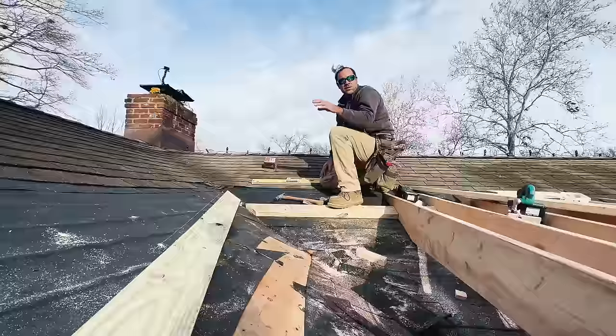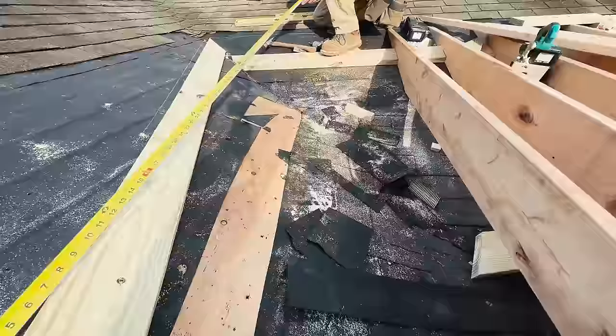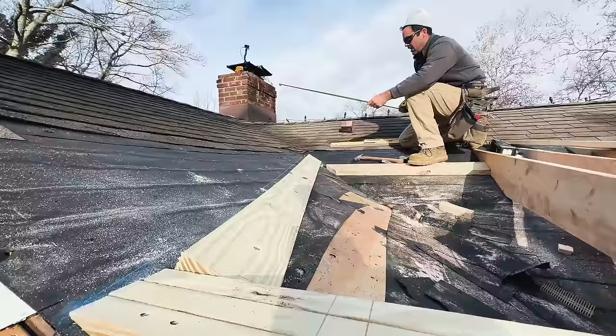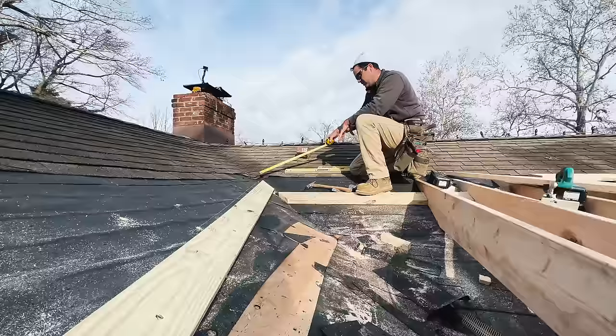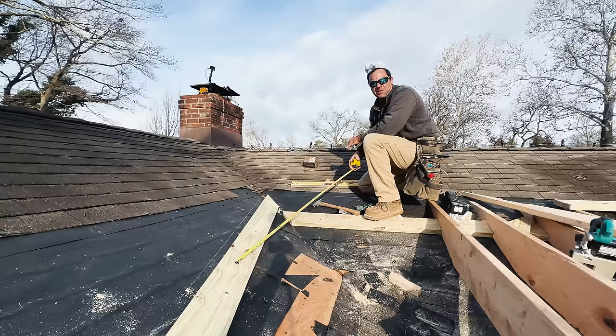So once we have our roof framed, we have to frame into another roof. So that's where a cricket is involved, or I'm just creating a valley. What I had to do is level our beam across, and that gives us our point where our roof will finish. And then I have these snapped lines, which are our framing of the top of our roof over here. So I connect those lines and it creates our new valley. And then you just frame accordingly to where this wood is set underneath the sheathing. So that would be considered my nailer.